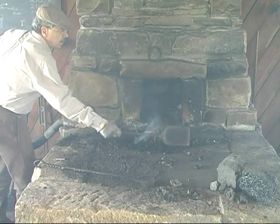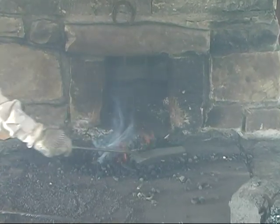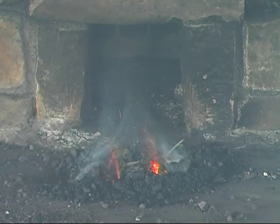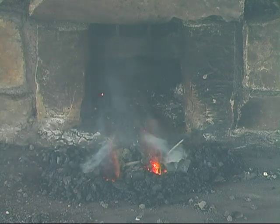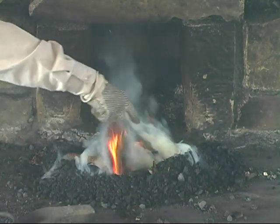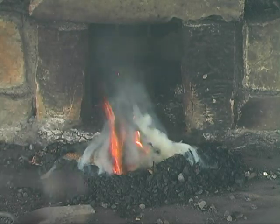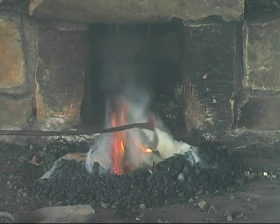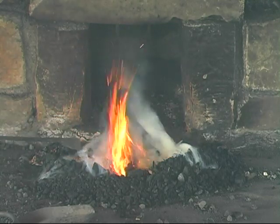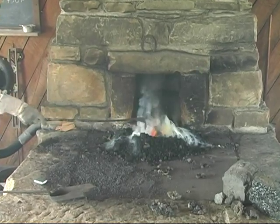What we're going to do is place coal along the edges and create an area that is going to be heated from the center. That stuff on the outside perimeter will be heated, and as it turns to coke, it won't be so smoky for us. As it burns in this area here, we can push this together — keep pushing it into the fire. You see where it's starting to smoke around the outside edges? That green coal is actually going to be made into coke. We have coke in the center from the last firing of the forge, and you can see it's smoking out here only because those edges are being coked.